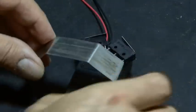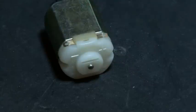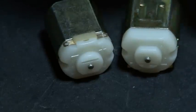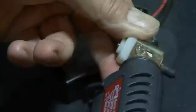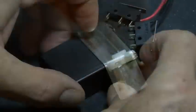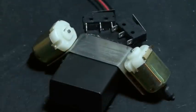We'll add some hot glue and lay our motor mount in place. You should notice on both of your motors a positive and negative marking — these are important for the way this will be wired up, as both motors need to run in opposite directions. So now it's time to glue our motors in place using some hot glue, and make sure that our little rubber tires are touching the ground.